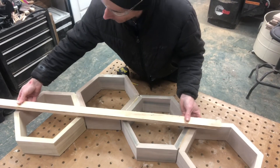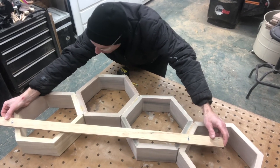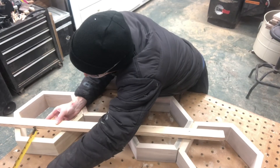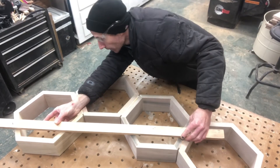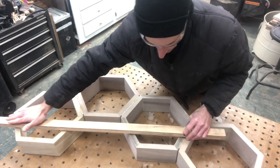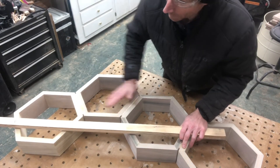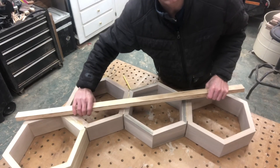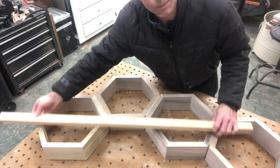I take my story stick and place it at a location that would serve me best for my keyholes. I want to make sure it's even from left to right. Once I get it positioned right, I push down and it'll make a mark of where my keyholes are going to go. I might configure it so the shelf hangs one way, or put them going a different way so I can configure this on a wall in a different spot.